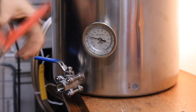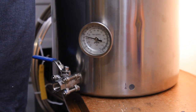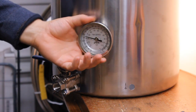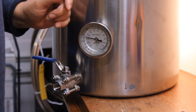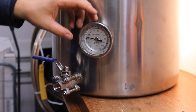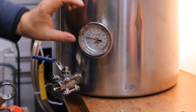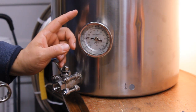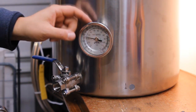Alright, so just while this is upright, you want to take a quick look at your gasket to make sure that it's crushed to about half of its original thickness, and that will tell you that it's going to create a decent seal. If you have to turn this, say, another 90 degrees to get the gasket to be crushed, one thing that I recommend doing is rotating the entire assembly, lock nut and all, nice and carefully counterclockwise to where it's about 45 degrees off, and then holding the lock nut and tightening the dial face back up to the upright position.